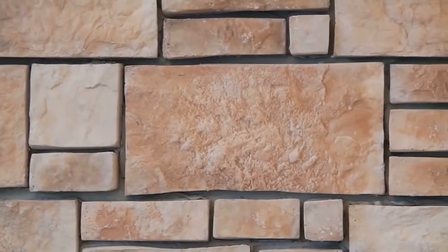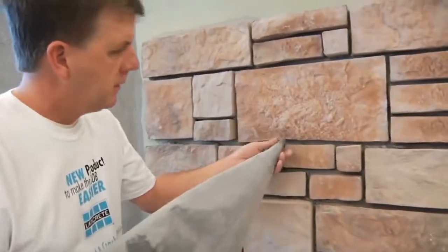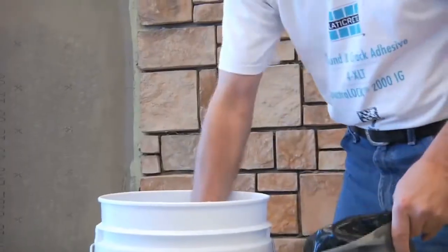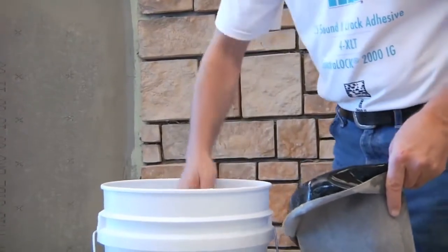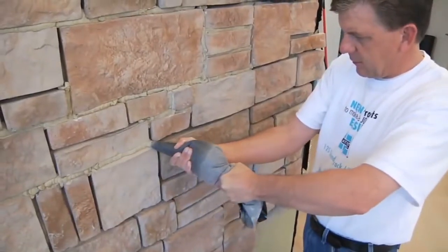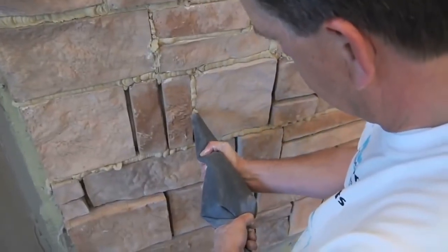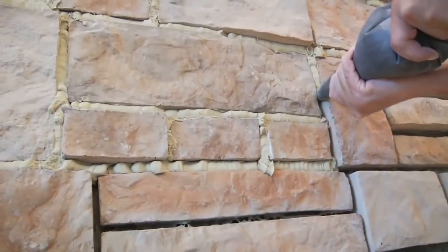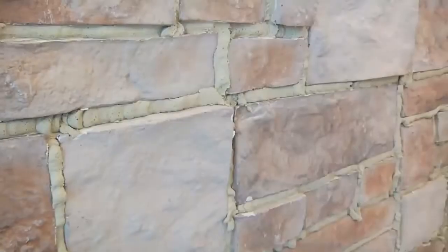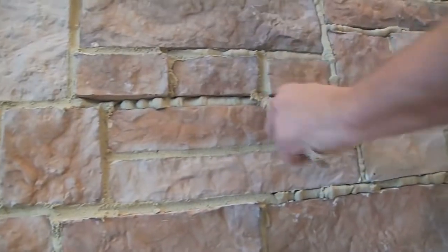The final step is to finish the installation by installing LATICRETE Masonry Pointing Mortar in one of the six available colors. Simply cut the tip of a grout application bag to a size that fits the joints to be filled. After mixing the pointing mortar with water only, load the mortar into the grout applicator bag. Apply the mortar to the joints, filling them completely, while being careful to minimize smears and droppings on the face of the installed veneer units. Any accidental smears or droppings can be removed with a stiff brush once the mortar has dried. When the mortar is thumbprint hard, finish the joints with a metal or wooden tool for desired appearance.